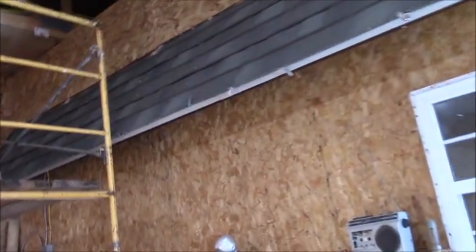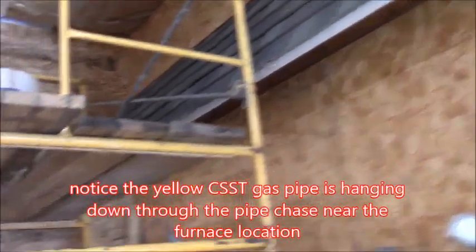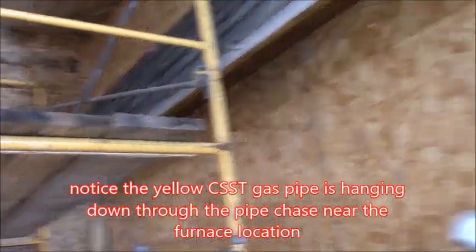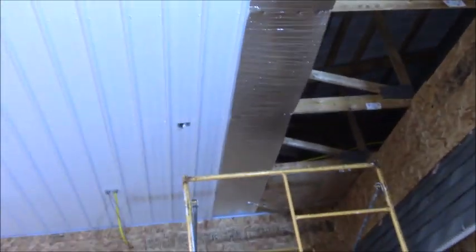And then hooking up the gas line outside, I just got to change a couple of pipe fittings. Change a 90 that comes out of the regulator to a T, so it's got a fitting going straight up that I can screw the pipe into, and my valve, and hook up my flexible pipe.